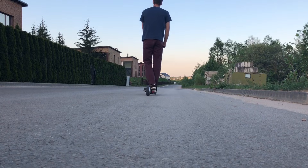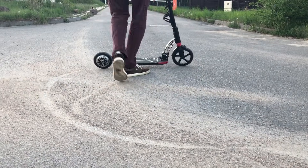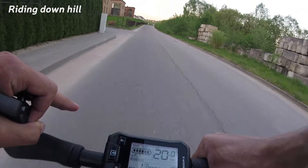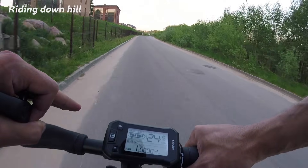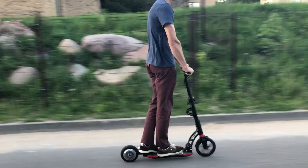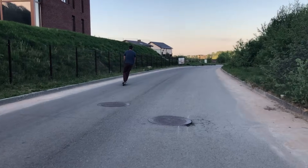Despite the small issues, the scooter runs awesome. I didn't try to make the best scooter in the world — the main goal was to check whether it's possible to use hoverboard parts and some cheap electronics and fit them nicely inside a regular kick scooter. I think I did it quite well. It can reach 24 km/h on a small downhill, 20 km/h uphill, and about 22 km/h on flat road. Keeping in mind that my weight is 90 kg, that's really not bad. Range per charge is between 15 and 18 km depending on speed. The scooter is still foldable, portable, and weighs only 12 kg. I hope this video was helpful — if you're new here, please hit subscribe for upcoming videos. Thanks for watching.